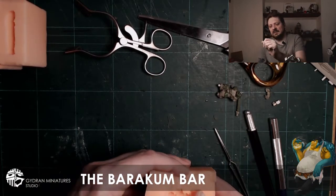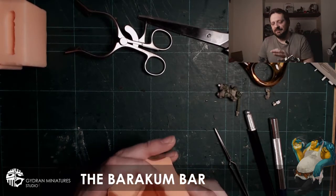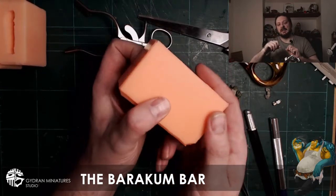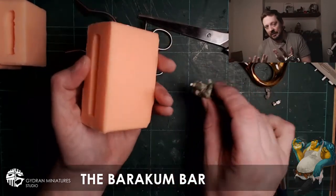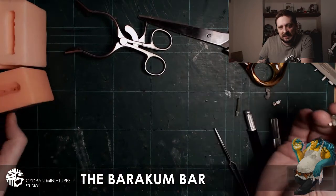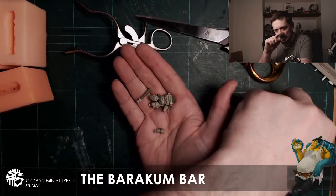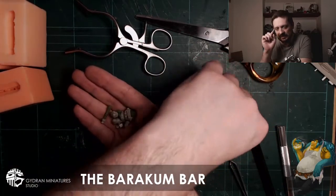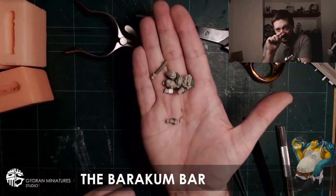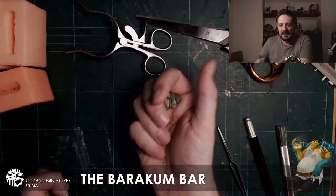When that goes into the pressure chamber, basically all the resin gets pushed into all these parts from the pressure, and all the bubbles are crushed. So it should all come out absolutely fine. When it comes to the production molds, I shall quickly go over them and double check the parts to make sure there's nothing there, and fill in the gaps if there is a problem, and recreate it if I need to. That's basically what my morning's been.